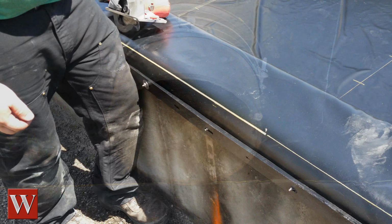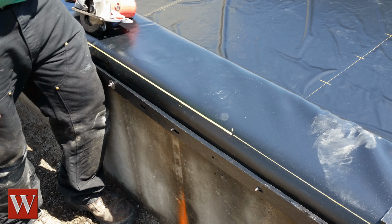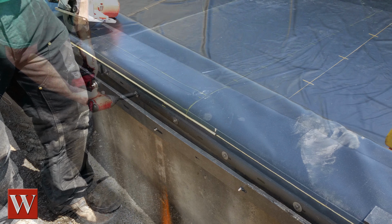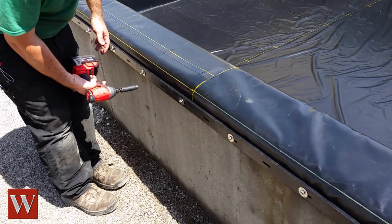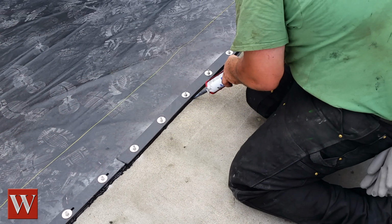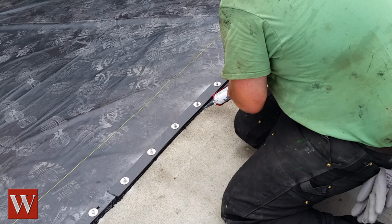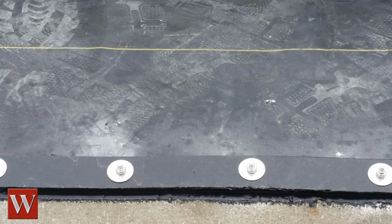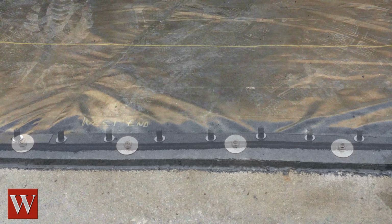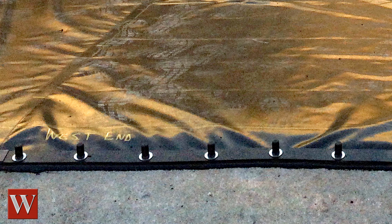After the liner was positioned and welded together, the compression strips were fitted over the studs of the anchor bolts and the nuts and washers installed. At the area where liquid seal was needed, a high-quality caulk was applied between the liner and concrete before fastening the hardware. A top coat of sealant was also applied. For safety, plastic caps were installed over the exposed studs.